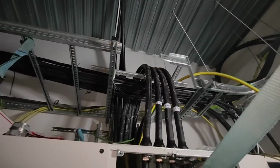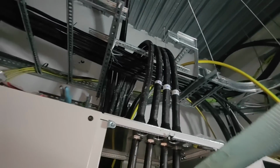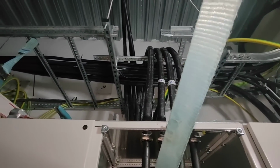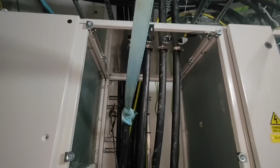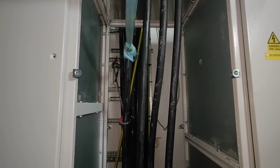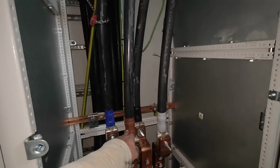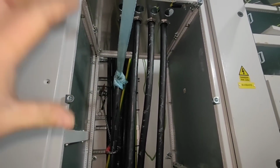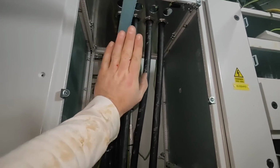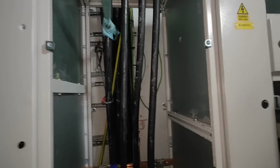Okie dokie, the story so far. So they'll loop over now. There we go. I need to label that one up, and you can't see for the belt, it needs straightening slightly that way. So then they come in. Now, I don't like doing this usually with single core cable, but because it's about 1300 mil from the lug to the actual gland, you've got a chance. You can let them float to the back and then go straight in. So I've managed that.